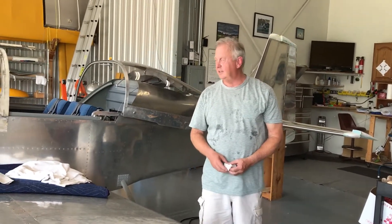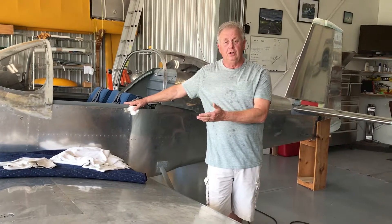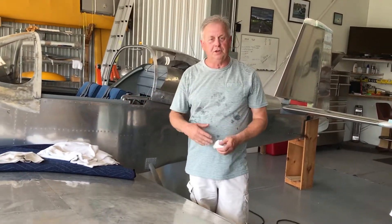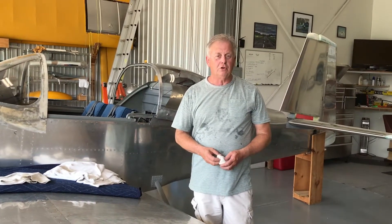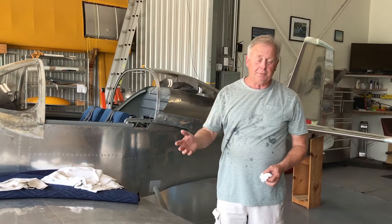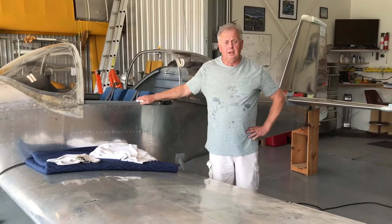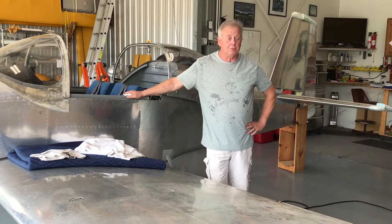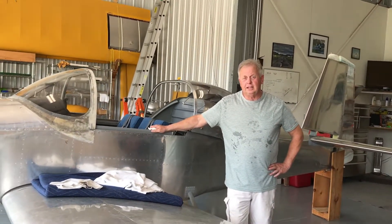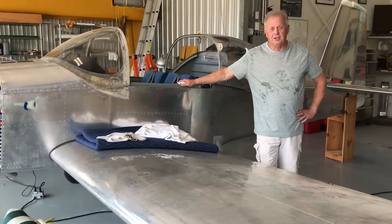What's behind the 21 years — was there a period where you didn't do any work at all? Yeah. I was building and renovating a house for six or seven years, so I didn't work on it then. I also stopped building for a while because of the nose gear collapsing and planes flipping over. I finally realized after talking to enough people it was mainly a pilot error — landing on a short airstrip, pulling the brakes, putting a lot of pressure on the nose wheel, the nose wheel grabbing a divot and flipping it over. So I stopped building until I was satisfied about how they fixed the problem.